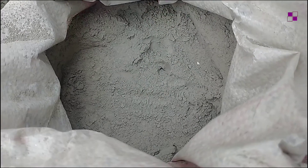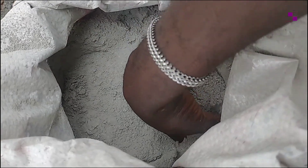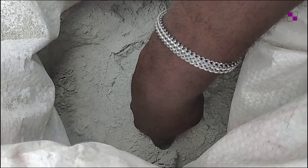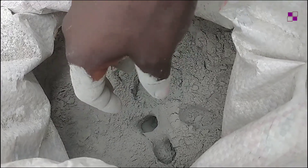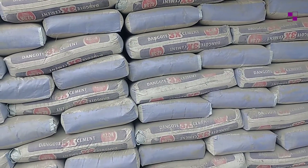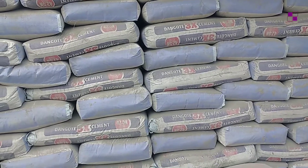You can also proceed by dipping your hand into the cement bag and feeling the temperature. If the cement is warm, it is already absorbing moisture — that is the reason why it is warm — and the cement is not good anymore; its strength is reducing gradually. But if the temperature is cool and normal, then the cement is good.